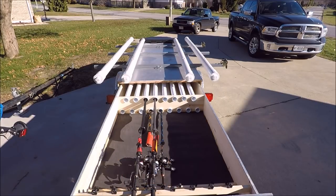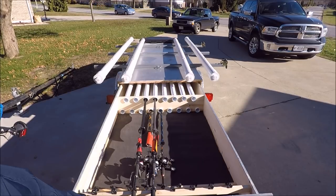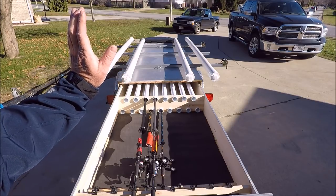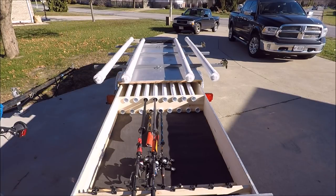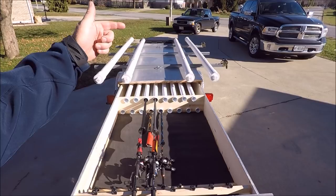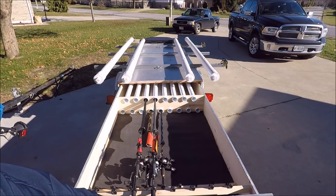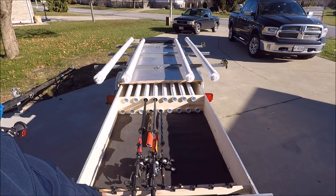The drawer itself is built, again, out of half-inch plywood. I had all my measurements figured out before going to Home Depot, so I just had them use their panel saw to slice things up to the sizes I needed. The overall box is a full eight feet long — a full sheet of plywood. The drawer itself I went about an inch and a half under the eight feet. Once I put the back panel on the box, it takes up a half inch, so I gave myself a little leeway. So the drawer is an inch and a half shorter.